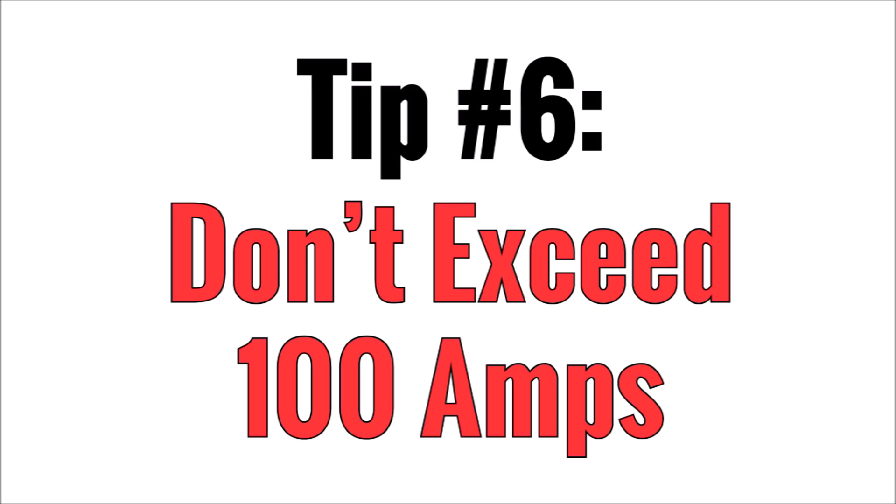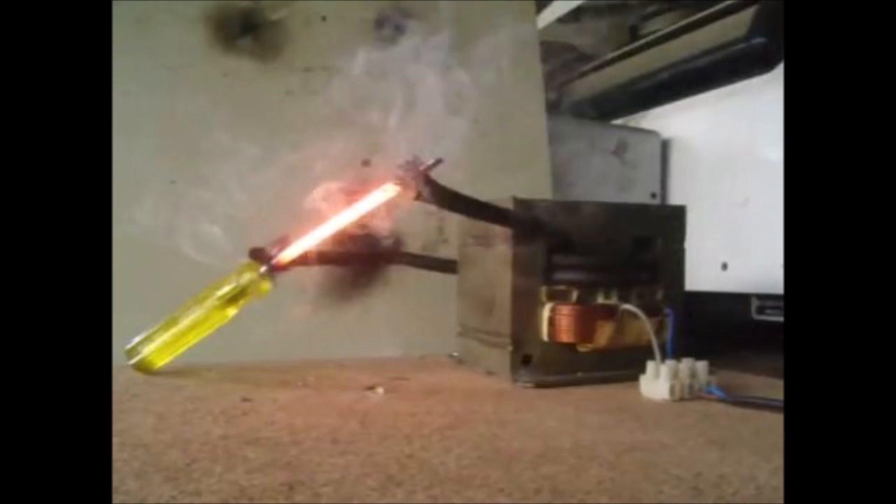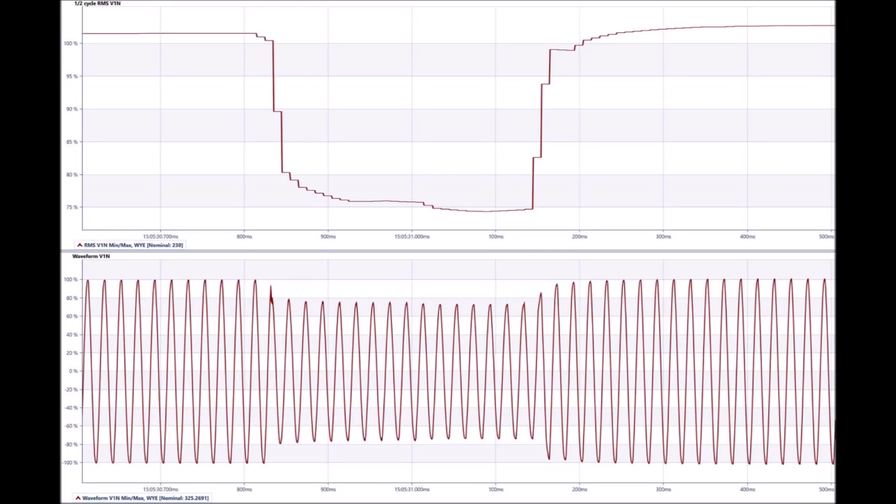And last but not least, tip number six is don't go above 100 amps. There are too many problems and too much danger with using high current. If you make a mistake with that much current you can seriously injure yourself or even kill yourself or burn down your house. Don't get me wrong, you can still start a fire with lesser current, but there's a reason why almost all charge controllers on the market max out at 80 amps. Deep cycle batteries don't like to provide high current like starter batteries do — they aren't built the same way and the voltage will sag under high load. Your inverter has a voltage range that it will operate within, and if the battery bank voltage drops too low the inverter will shut itself off.